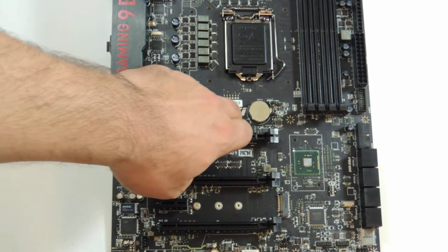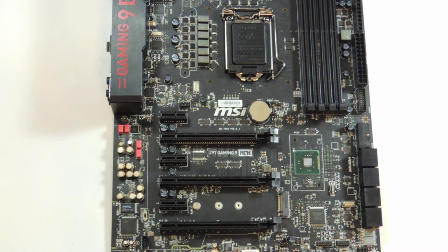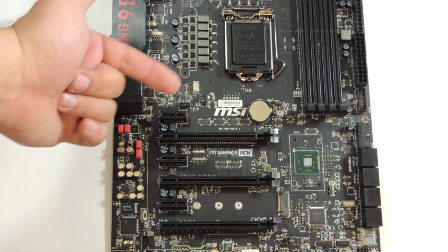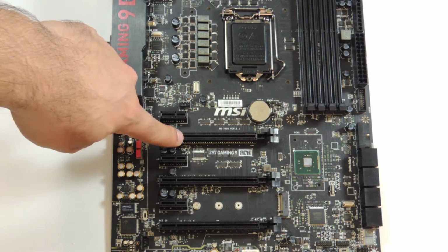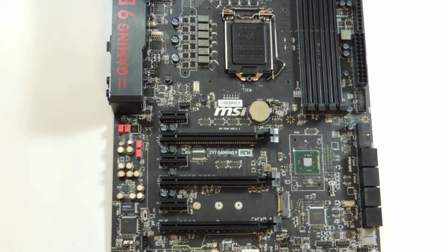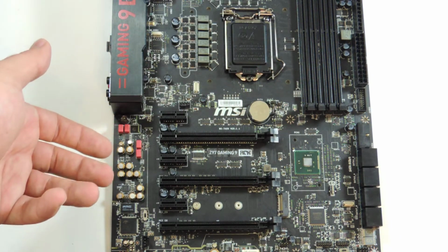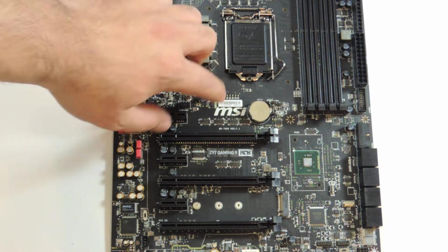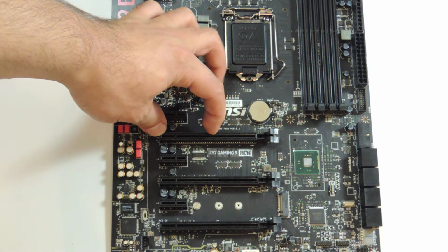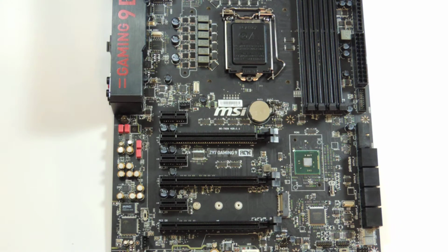Anyways, there are 6 PCIe 3.0 quick switches from ASMedia. I think they're ASM1480s. Okay, and they each switch 2 PCIe lanes in 1 or 2 directions. So this can switch 2 lanes either here or here, stuff like that. But actually, that's not how it works. So 16x comes out of here in bundles of, I believe, 4, or 2. And the first 8x here is hardwired to the CPU. Boom. 8x. Boom. The second 8x is where we get our magic.